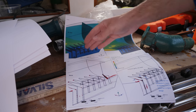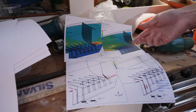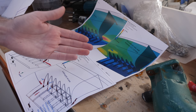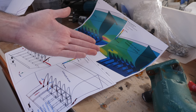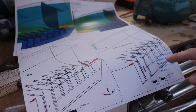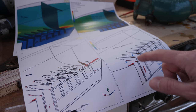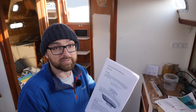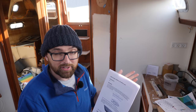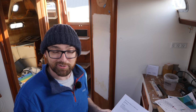Over here is the structure with the core intact, and over here is the structure with the core completely rotted away but with added laminate laid up on top of the structural members. He's doubled the laminate thickness — gone from three millimeters to six millimeters — and this is basically as good as with the core intact. He's added a note that says just a little bit more thickness in some areas is needed to achieve the same stress levels as in the original design. To sum up: if I double the laminate thickness from three to six millimeters, it shouldn't matter if the core disintegrates. I think I'm going to add six millimeters of laminate on top of the existing three millimeters for a total of nine millimeters, which should give me a good safety margin.